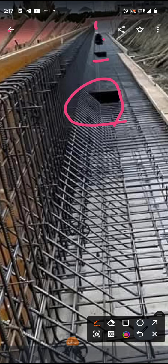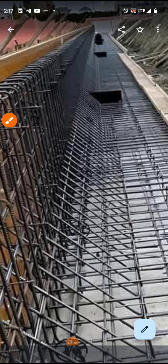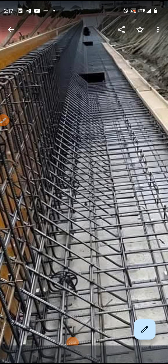It allowed water to come down and escape through the face, which would just put water on the other side of the wall. You'd have to make sure you keep continuing getting that water off, running it away. So yeah, the reinforcement's nicely spaced, but there's a few negatives I don't like, and I talked about that keyway specifically. And let's go ahead and end this video.